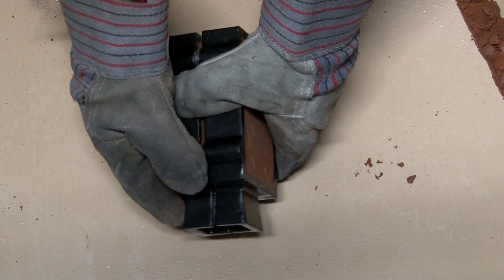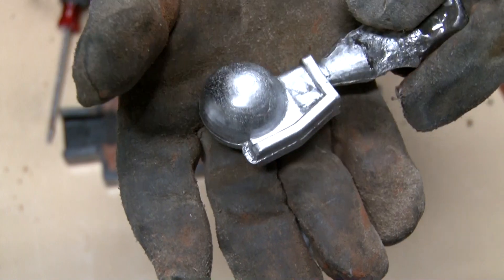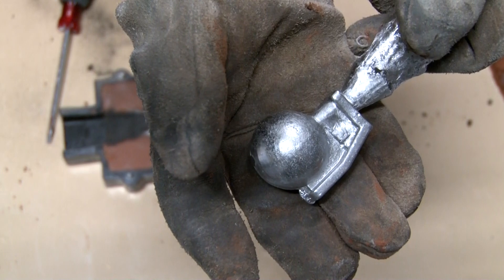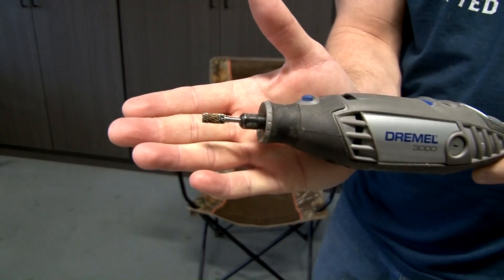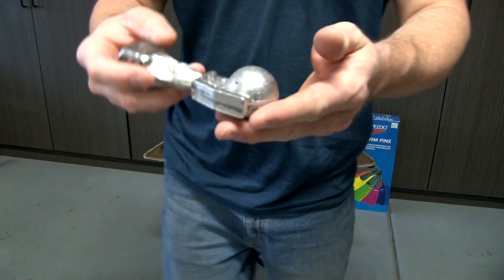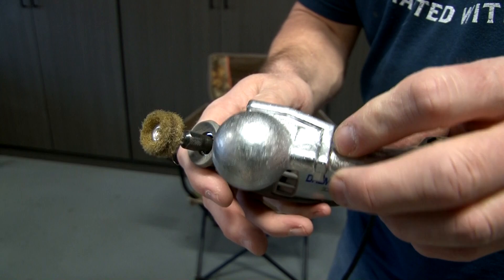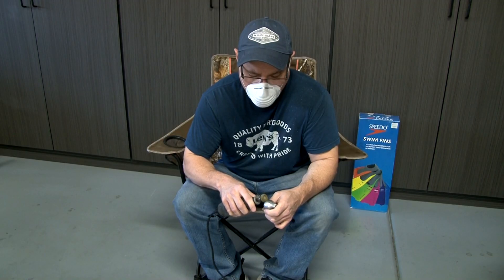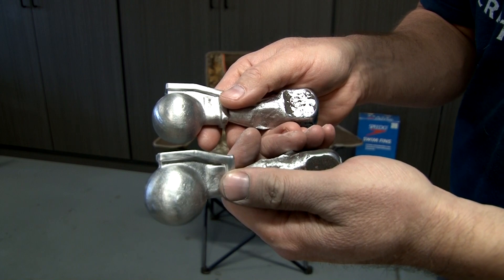Here's the second one. It seems pretty similar to the first — we have a little bit of flashing that needs to be dremeled off, the tear-out at the bottom of the handle needs to be cleaned up, and there's a little bit of shrinkage at the neck too. Here's the little burr on the Dremel I'm going to use to clean up the flashing. This is what it looks like after the flashing has been removed and an abrasive wheel has been used to clean up the aluminum.